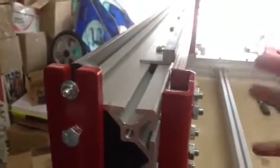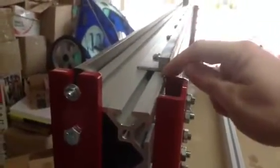I also noticed a gap between this riser and the extrusion. When I loosened the bolts and pushed both bumpers against it, that gap was still there — and I said, okay, that's where it wants to sit and be level. So what I did was shim this whole side where I saw that gap — I just put little washers in there and sucked it all down. Now I got bumper touch and bumper touch.